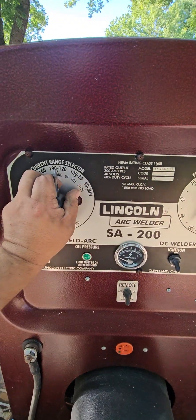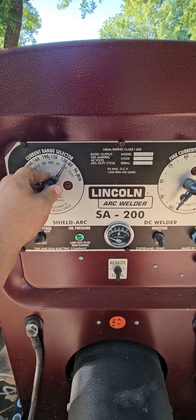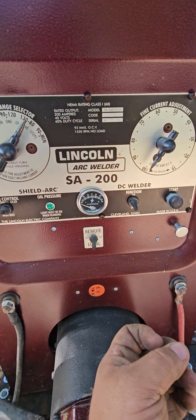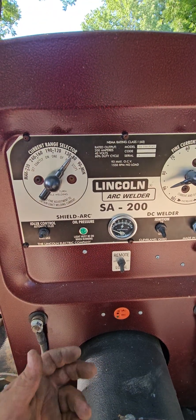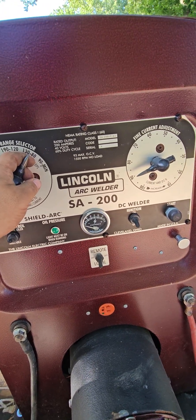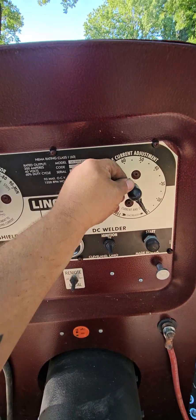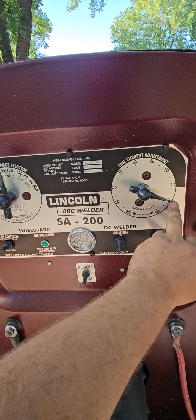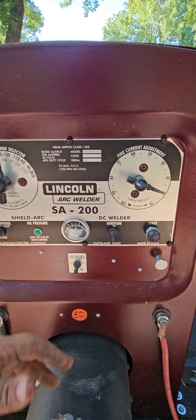It's a little different in other gears. Let's say we're in second gear and it maxes out at 130 amps — that's a very violent arc with lots of dig, or arc force. Our volts are really high. But let's say we still need 120 amps — if we dial it down to about 10 or 20, we'd be around 120 amps but with very low arc force or dig, making it much smoother.